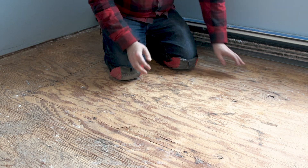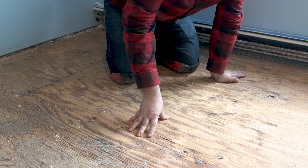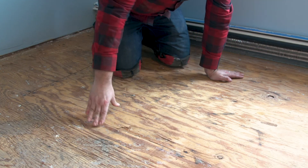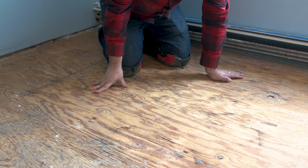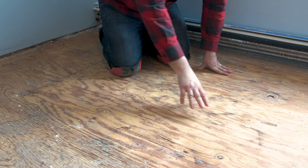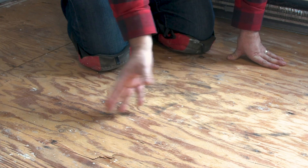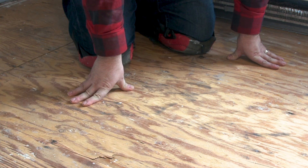To fix this there's a pretty simple plan. What I need to do is cut the bad piece of board out and replace it with a new piece of plywood. You'll see on the seam right here, this is just empty space — the studs follow these nail lines. I'll cut a section out about 16 by 16 inches, because it's 16 inches between the studs, and then I'll replace, glue, and screw back in the replacement board.